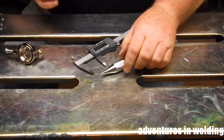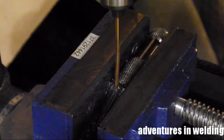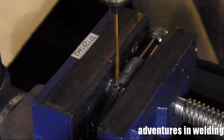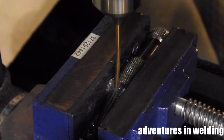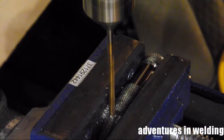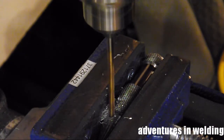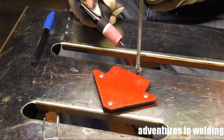Well, that makes the drilling a little more challenging but we'll get it done. Start with a small bit, move to a larger bit. Look at that — wonder drill press from that place that sells low-cost tools. There's a thicker one — we keep going until we get up to the proper diameter. I'm pecking — this is how you drill in steel.